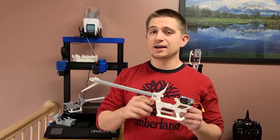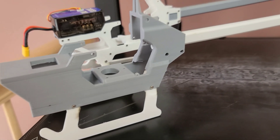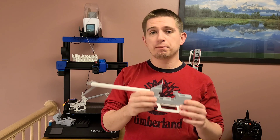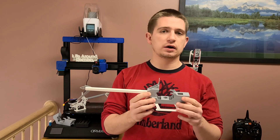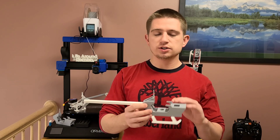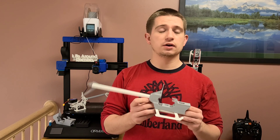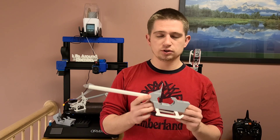Hey guys, it's Damien here. In my last video I told you I would not be using this chassis anymore — my exciting news is that I've removed all the screws and parts of this chassis down to just one piece. I've combined 10 parts into just one 3D printed part, also removing 30 screws. I was considering selling this model but I'm truly trying to expedite getting 3D printed helicopters to market, so I will be giving this design out for anybody to print completely for free.